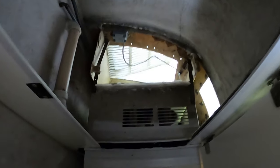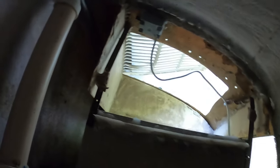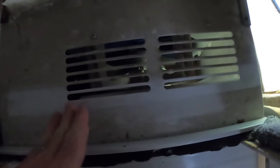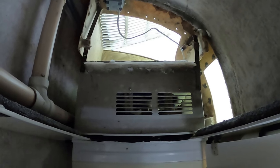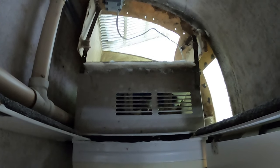So I started looking everywhere around on the inside here, and I thought for sure it was leaking into this compartment and everything was getting soaking wet. But I found no evidence of that. There is a little bit of water here. That's because about an hour ago I moved the Casita up to the porch where it's sitting now, and some of the water that I found in the air conditioner, you might be able to see it down in there, was pooling down in the bottom. It was not exiting to the outside world. So my hypothesis is that the condensate drain hole is plugged with debris.